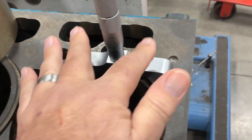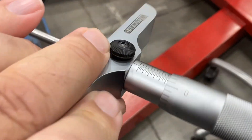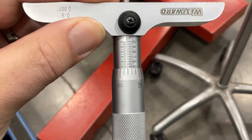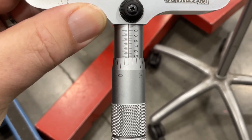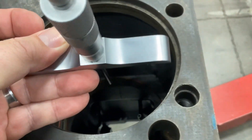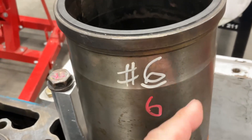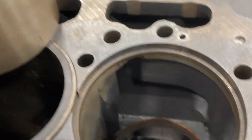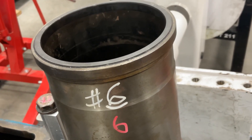I hope this video helps you understand how to use these. Understanding how to take these measurements is a key part of building engines. There are digital versions on the market where you just tell it which rod you put in and the display shows the counterbore depth. Measuring counterbore depth and understanding the straightness of this ledge matters because the sleeve sits on top of it — if the ledge isn't straight, the sleeve isn't straight, and we don't want a piston traveling inside something that's not straight.